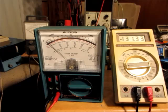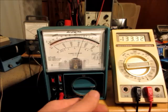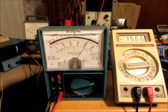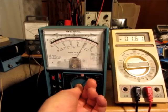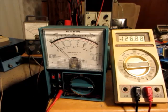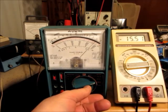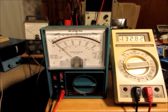Here's an old Archer kit — Radio Shack VOM kit from the 70s. On the one ohm range it's putting out 132 milliamps. On 10 ohms it's 15 milliamps, then 1.6 milliamps, then fractions of milliamps on higher ranges. That one's putting out the highest current — that would blow any 1U4 tube. So if you put these VOMs on the lowest range, it'll blow the filament for sure.